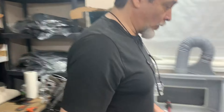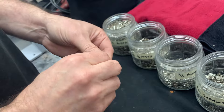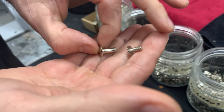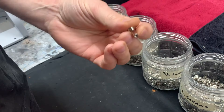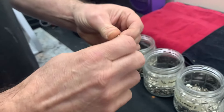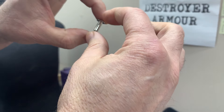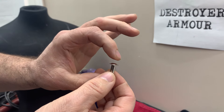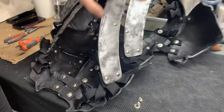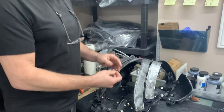So what is a Chicago screw? We have them in different sizes, and I'll use the example of a half-inch. A Chicago screw is basically a male and female — it's the same principle as a nut and a bolt. Your screw is your typical screw, but really the female as the nut is what differentiates the two. They go together like your typical nut and bolt would. The only difference is you're combining something to compress two pieces. We use these in different lengths depending on where exactly they need to be attached, and they're strategically placed all over the armor. This is everything that we use to assemble it.